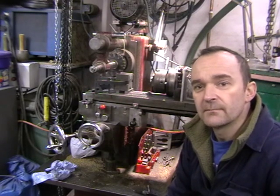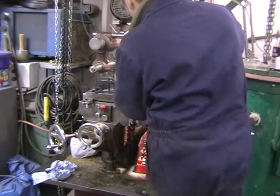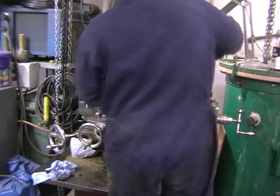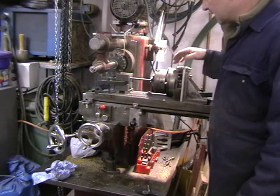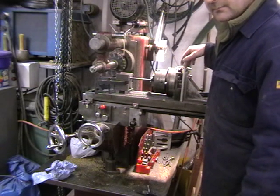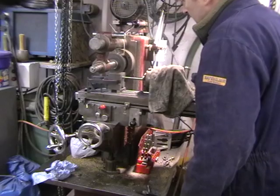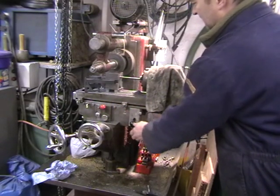I'm going to put a blank in, set it up running and you can see it in action. I'm actually going to put a cloth over the chuck here because all the shavings that come off get all over the indexing bar, the clamps and what have you. And of course you don't want to get your fingers on that, so by putting a cloth over it, it's covered. Right, here we go — just winding up to the job, engaging the power feed, and away we go.